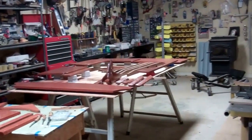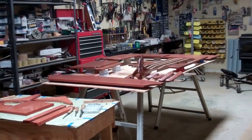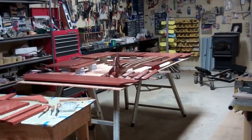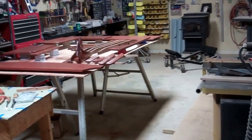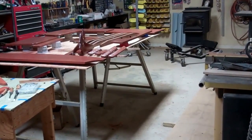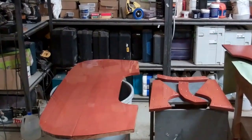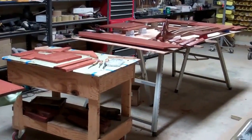We have, if I remember correctly, three coats of varnish on these elements so far. The undersides of the seating components and other interior components will be finished in Lyman sand tan bilge paint, as is proper and appropriate because that's how they came from the factory. After staining and before applying varnish, every piece of wood here was treated with full coats of Smith's penetrating epoxy sealer, then sanded ever so lightly — that sealer just provides incredible teeth to the varnish.